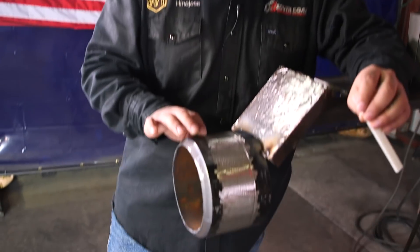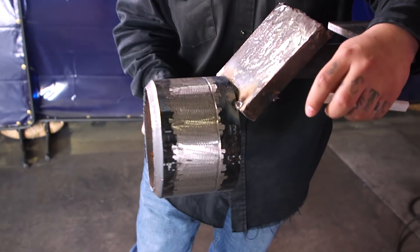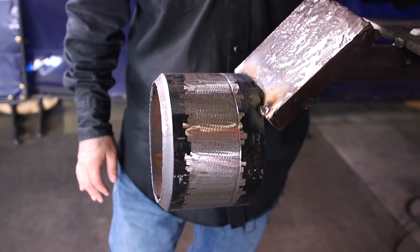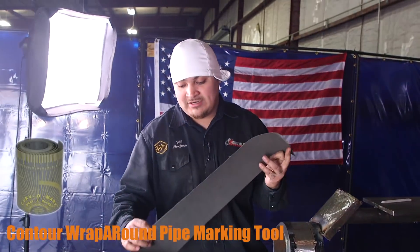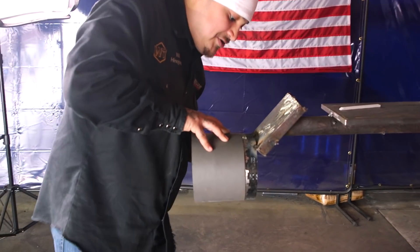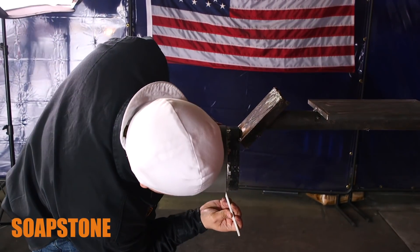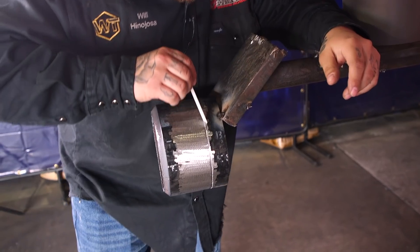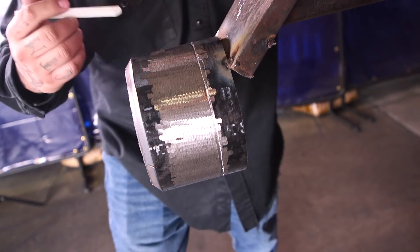I have a pipe tacked here in the 5G position and this pipe is actually a blank pipe — it has no weld on it. So whenever you're running beads on it, you can tend to get lost, kind of swirling around the pipe. What I use is called a wrap-around. You wrap it around the pipe, which gives you a straight line. I use a soapstone to mark my line all the way around the pipe. Then I get the grinder and make a nice deep line — that's how I start my first bead on a blank pipe.